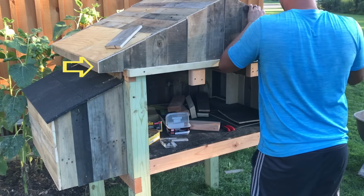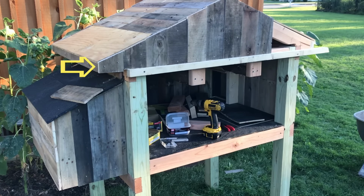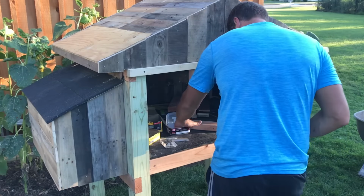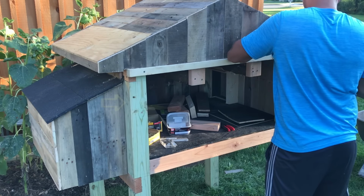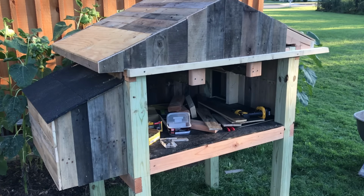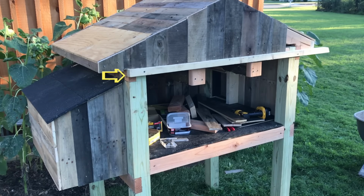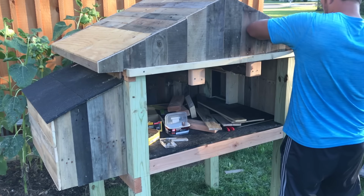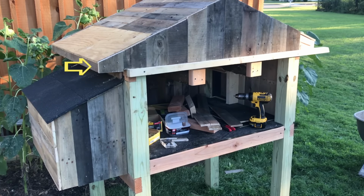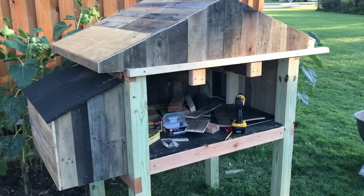If you look right here on the coop, you'll see this piece of wood right here is a little bit narrower than it initially was when I held up this crossboard. With the way that I framed the nesting box, which in hindsight I really hate, I was trying to avoid an additional cross piece right here. So I ended up tying the hinges in with this piece here. And the result was that I really couldn't open the nesting box door very much. So I ended up having to hack off a part of this to make sure I could open the nesting box door enough.